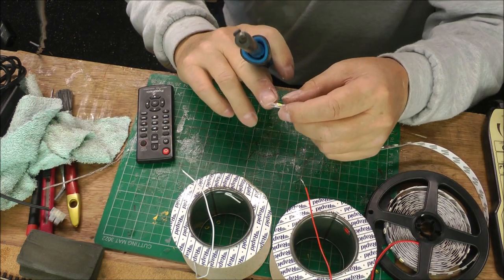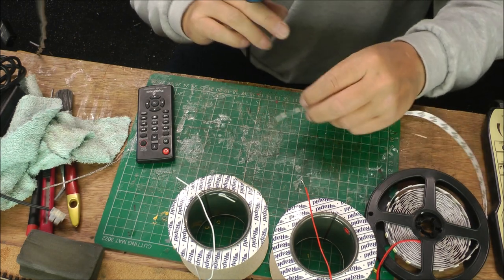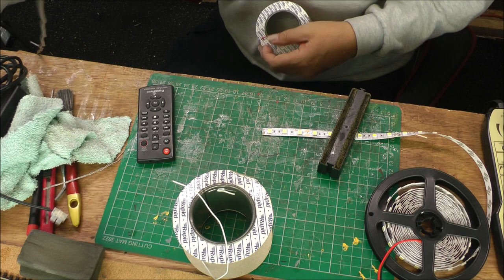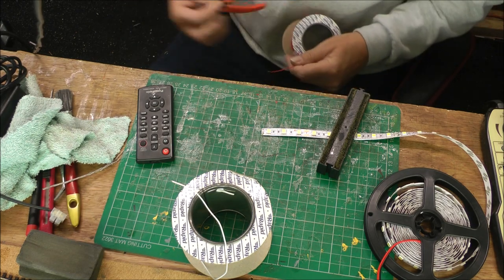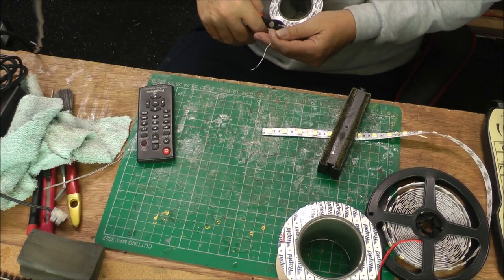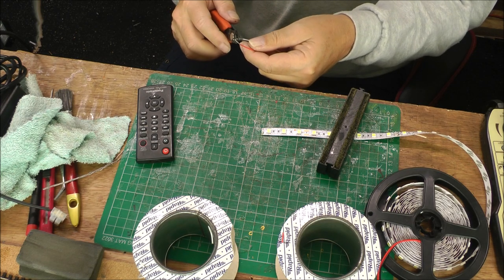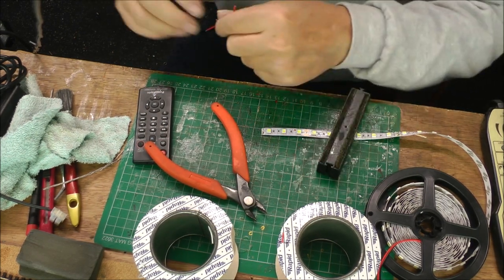And there is a positive sign and a negative sign, okay? So the negative... Well, I need something to hold that down there. There we go. Let me just trim this wire, because it doesn't need to be long. Just trim the end off. Oh, and these bits are too long, you only want a couple of millimetres, because remember, you're only soldering them to a small pad.